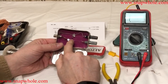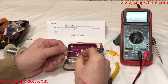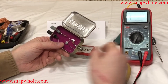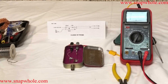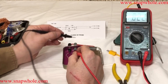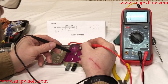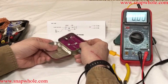Moving right along. I've got a resistor that goes from here to here — a 4.7 meg resistor. I'm going to go ahead and tin the ends of this. Okay, that seems to be wired. So let's give this a test — we just want to do continuity. Okay, so we have a reasonable expectation that this is working.